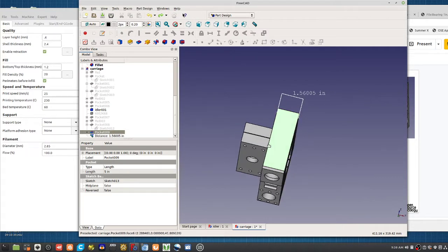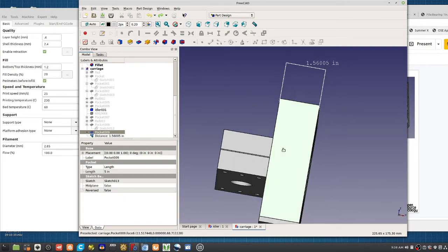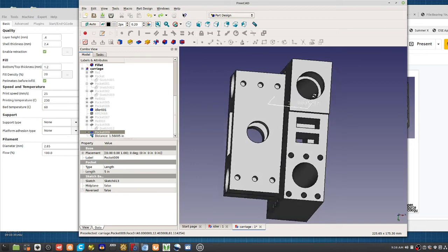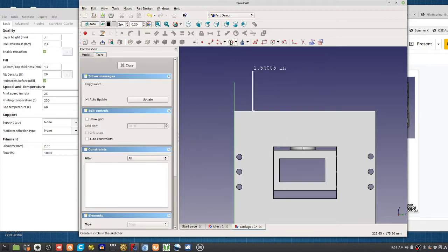So now, if you have a 2-inch bolt though, and this is 40 millimeters, then you're threading in only 10 millimeters, you'd like to thread in a little more. So what I would do is a countersink on these things so the bolt actually goes in a little deeper. On that face, I would countersink it, meaning do a pocket around that for the bolt head.